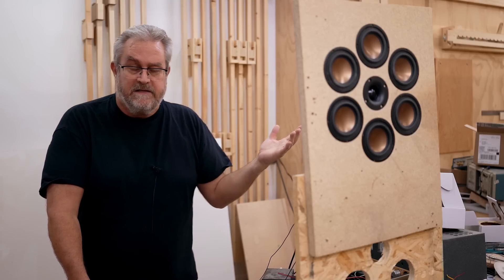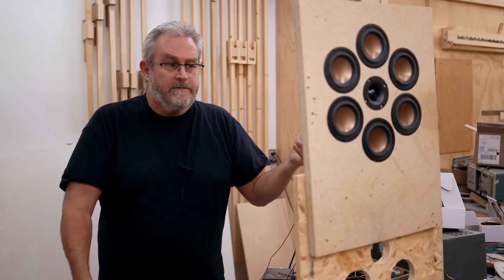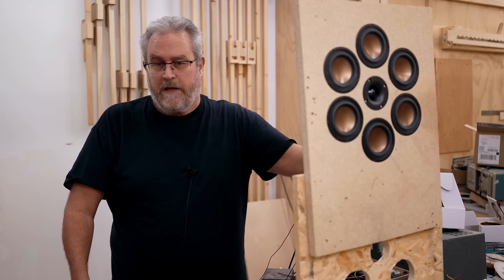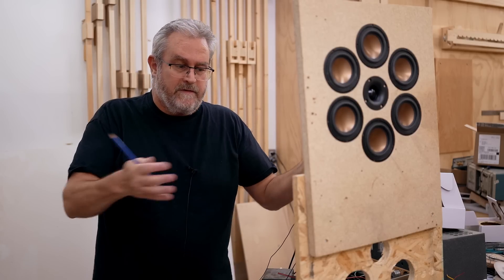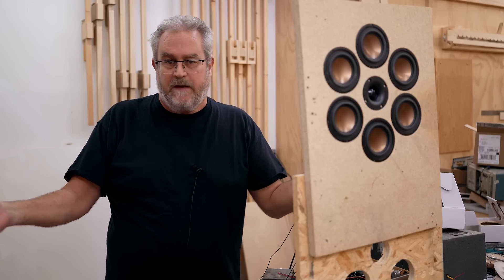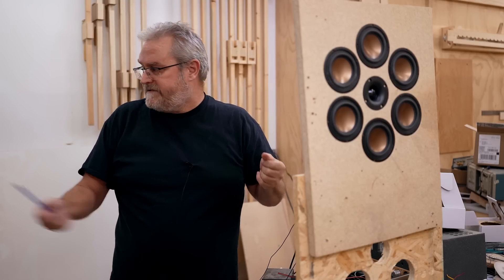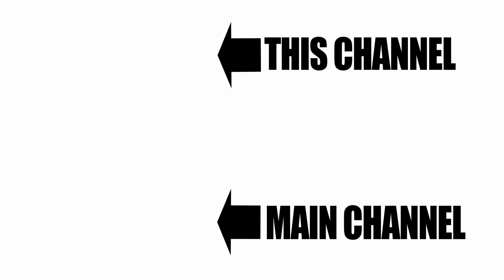The goal was to make something fairly efficient, a little higher sensitivity — there's not much point using this many drivers if you're not getting something interesting out of it. The other feature is it behaves like a coax without being a coax, so it's a point source from 20 kHz down to around 300 Hz wherever the woofer crosses. I thought it was an interesting idea. I'm not starting on this design yet though — I'm still working on my 10-channel amplifier and making good progress, with an update video coming fairly soon.